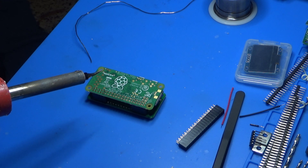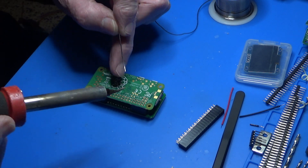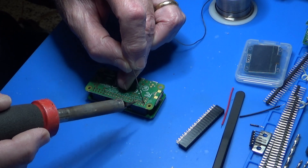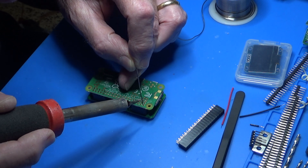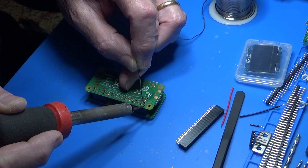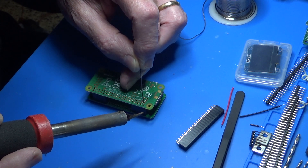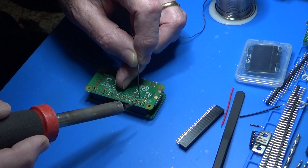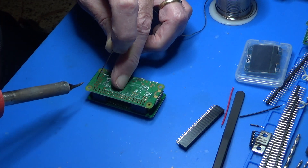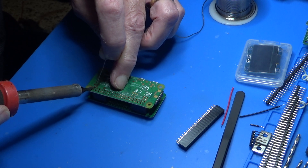We don't want to hit the traces and tracks for too long. If you're running a temp-controlled iron, I think you need to have it on at least about 310 degrees — certainly over 300. The Hakko that I used at VK Direct, we had to crank that up to about 310 before I was happy with the amount of heat. So basically, all I do here is offer the solder up to the item, then bring the heat in — the solder's on the opposite side to the pin I'm heating — and I just plunge that heat in, put the solder in, a couple of dabs. I normally solder the opposing pin on the other end first, and that way I'm pretty much done with holding the board down.